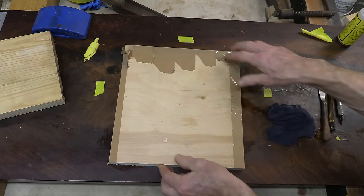Right, the top looks good. Last night I came in and rinsed off all the oxalic acid really well. I noticed at that time some bubbles had come up, which kind of doesn't surprise me. I thought there were some loose places that I couldn't find. In fact, sure enough, this morning I can find some of them, but other ones have just disappeared. They've shrunk back down. But I've got a few here I want to glue down before the next step.